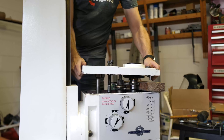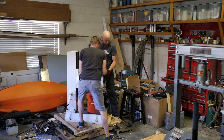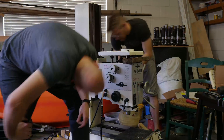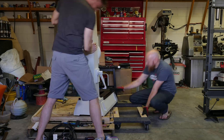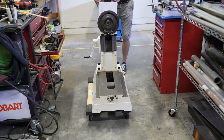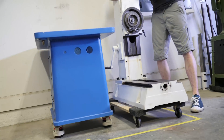Not as bad as the surface grinder build-your-own, but a good mix of off-the-shelf and homemade parts. We picked up a 940 because it's a good size, reasonably solid, and a similar size and format to the Tormach. There are also some CNC kit parts we can leverage. I actually don't think this would make a very good manual mill, just because of the handle location on the Z, and I have some questions about the main column. But we'll see. Other than that, it seems reasonably well-built. Foreshadowing.